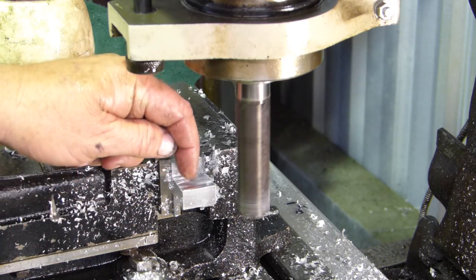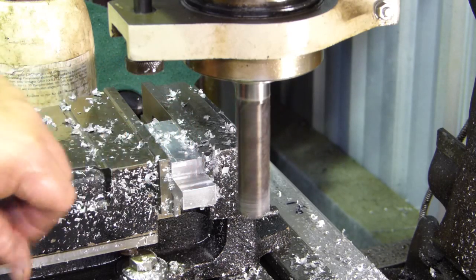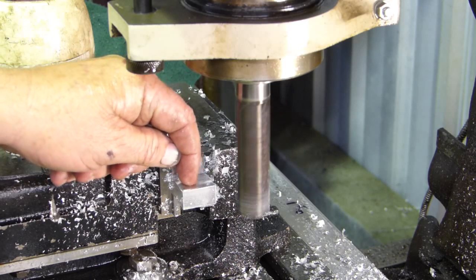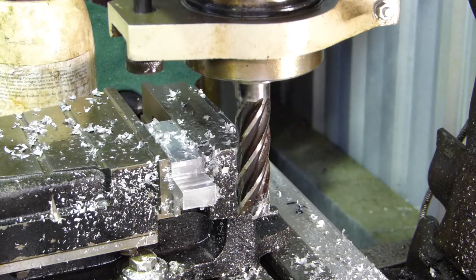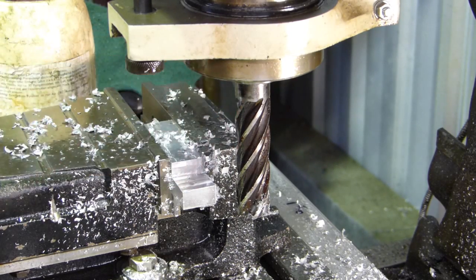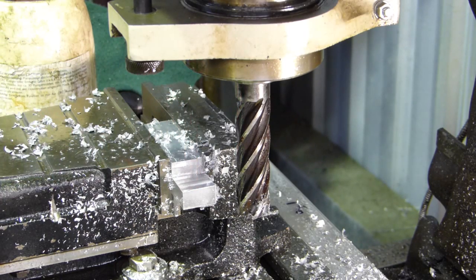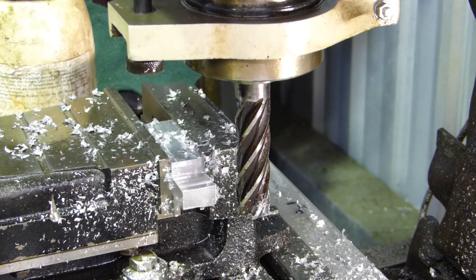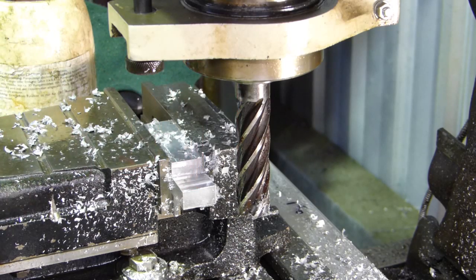We've got the shoulder, so now we need to drill a hole down here, right up near this shoulder, or reasonably close to the shoulder, and then cut down here so we can clamp the dial gauge in. So while we have this set up, we'll put a chuck in there and we'll just drill. We'll measure the stem of the dial indicator, and we'll drill a hole the right size, just a snug fit at this stage, and later on we can bring this little cut in through here.